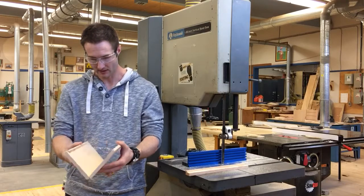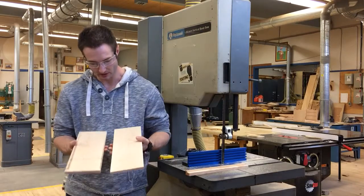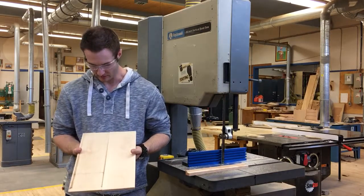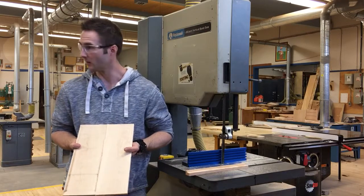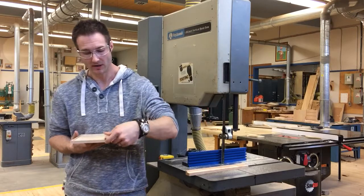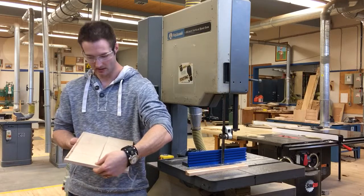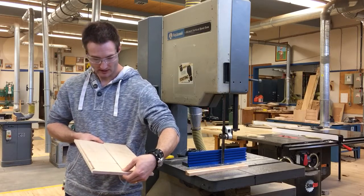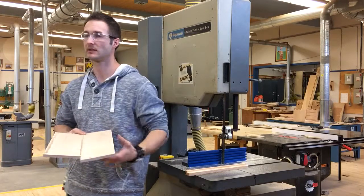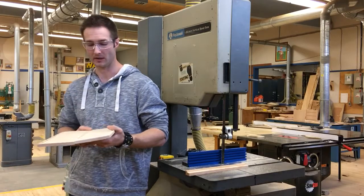Now that's our inside face. When we flip that, we can re-joint these inside edges that we're going to glue up, and our grain is going to be a mirror image of each other. When you guys glue these up, just be very careful to make sure that we're exactly flush — as equal as we can — nice and flush on the faces. Because we need as much thickness as we possibly can. We're going to try to dress this final panel to 3/8ths of an inch thick and we're going to do that in a thickness sander.